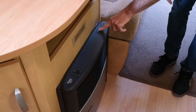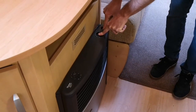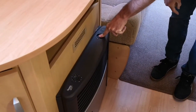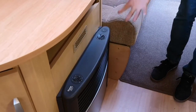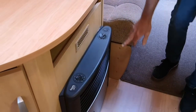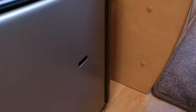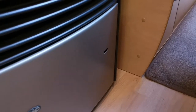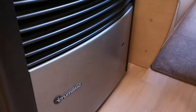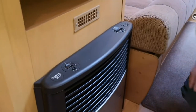So turn it round to 10, hold that in, and we normally hit the piezo button four or five times, then leave it for a second and release. You should then hear the fire roar up — you'll actually hear it roar up. There is also a little spy hole just here which you can look through. You've got to get the right angle, but you'll see a little blue flame in there. On 90% of new fires you'll actually hear it roar up and hear it running, and that's how to light it on gas.